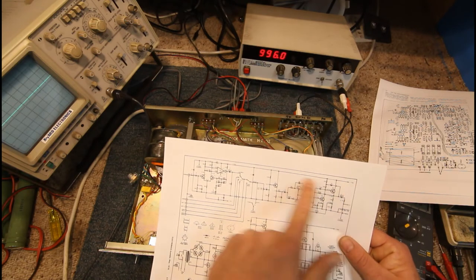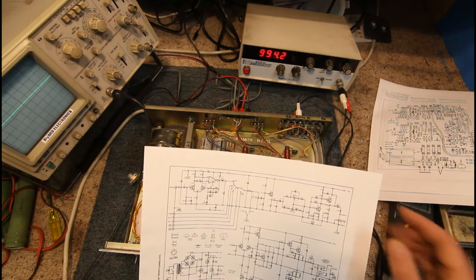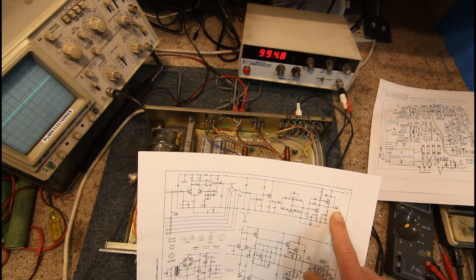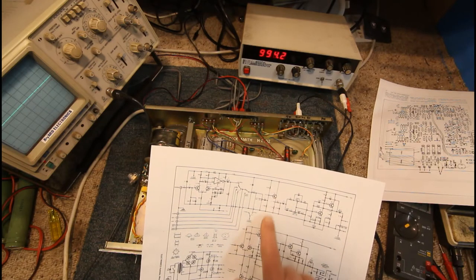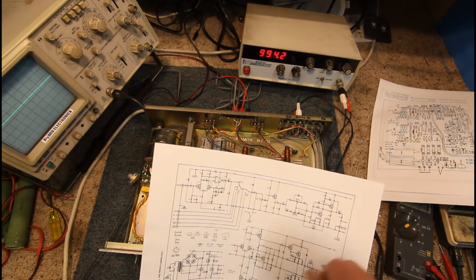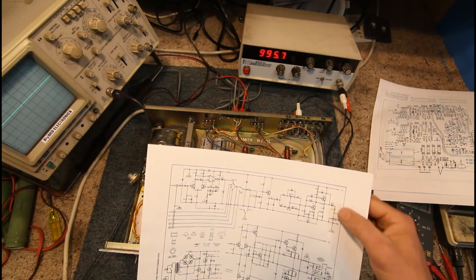After the volume control, there's a transistor to boost the signal a bit and isolate the tone controls. The bass and treble controls use resistors and capacitors that alter the frequency response — turning it one way basically pulls bass frequencies to ground removing them, and the other way boosts them. The same with the treble — one end removes it, the other boosts it. There's a capacitor, then a transistor, all running off plus and minus 15 volts. Then we get into our first preamp stage and there's the balance control.